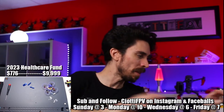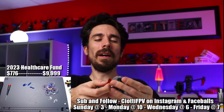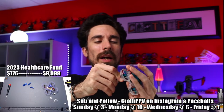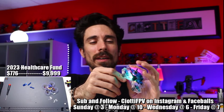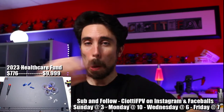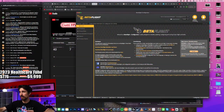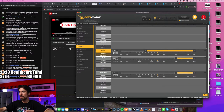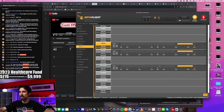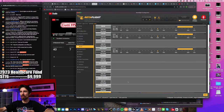I do want to plug this into Betaflight though, and sneeze again. But unfortunately, I'm not going to be able to sneeze again for at least 60 more seconds. I need to change the switch position for turtle mode, because I got it wrong, and it's been very annoying. So let's go into modes here, and we're going to take the beeper off of the middle switch position on aux 3, and put flip over after crash where it belongs on the middle position. And now all is right with the world.